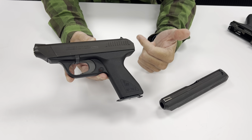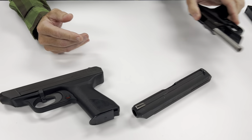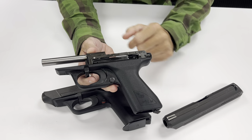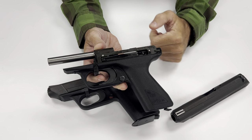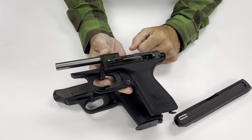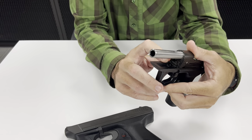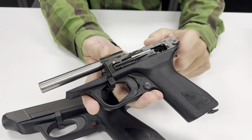Let's look at a few of the unique features of the weapon. First, the operating system. It's a 9-millimeter pistol — most 9-millimeter pistols are going to have some kind of delay system to control those higher-pressure forces. What's unique about the VP70 is that, as a nod to being simplistic and cost-effective, they didn't use a delay system. This is a simple blowback-operated weapon. You can see the barrel is pinned into the receiver — it is a non-reciprocating barrel, so it doesn't use a tilting Browning short-recoil system, and it doesn't use a gas-retarded delay system like the P7 series that would follow it. How did they manage that? You've got the mass of the slide itself, the resistance of the recoil spring, and an internal buffer right below the barrel as well. You don't see very many other 9-millimeter pistols that use simple blowback, but the VP70 did.